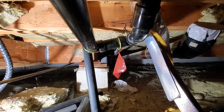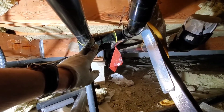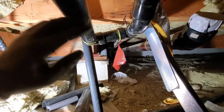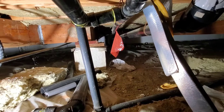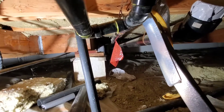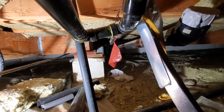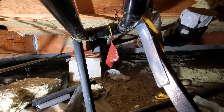This is another example of back-grading — sloping the wrong way. This is our sink; the high side should not be the low side. You can hear the water — we have puddling water here, and this is part of the reason why this sink was draining so slowly.